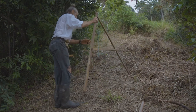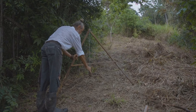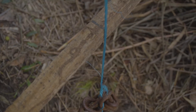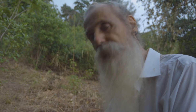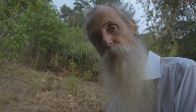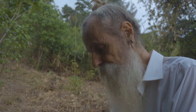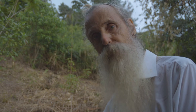You flip the legs and you make another mark on the other side. In order to maintain the gradient on our zigzag trail, we use the two marks on the A-frame that are equidistant from the plumb line — from the center line — which gives us our contour line. We have lines on either side of that center line that will give us a constant gradient as we go up the slope.